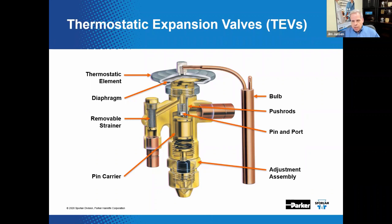One of the most important things to remember is this: the thermostatic expansion valve controls superheat at the location of the sensing bulb. That is the primary function of this device. TEVs are not intended to control box or space temperature, relative humidity, suction pressure, or compressor amp draw. It's only meant to control superheat where you've mounted the bulb and tied in the equalizer.